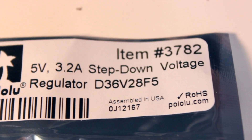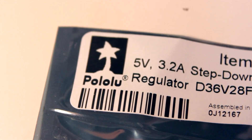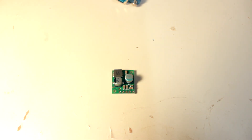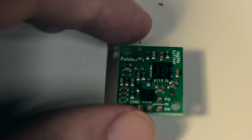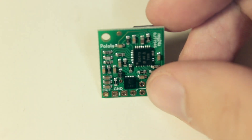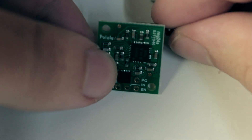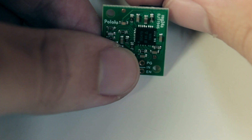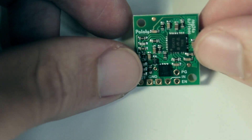Next up, how was I going to step down 42 volts to 5 volts in such a small space? Fully custom DIY builders have it easy and can just go with an off-the-shelf buck converter, but I needed something a lot smaller than that. I didn't really have an answer until I stumbled upon a company called Pololu — a Las Vegas-based electronics and robotics supplier. Their D36V28FX series step-down converters are tiny, cheap, and powerful enough to output over 1 amp to my USB port, all while being compatible with my 42-volt battery.